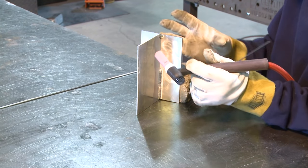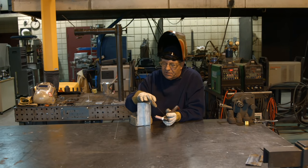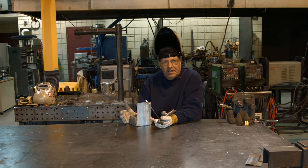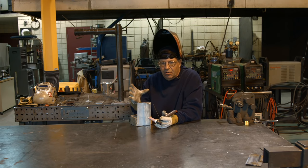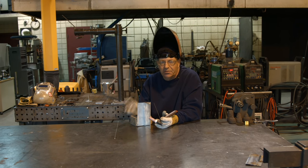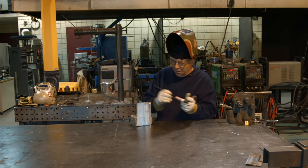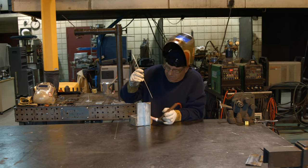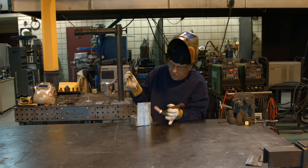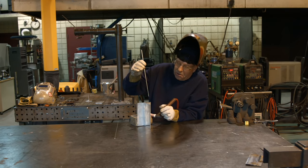There are a couple of things about doing this on aluminum. This thing is going to transfer heat quickly and just heat soak up at the top. I've seen a lot of people start out making a really beautiful weld and they never get off their heat — they get up to the top and their weld is real wide, real blown out, real flat. I'm trying to get a good angle for the camera. This is kind of freehand because I'm really not holding on to anything — I'm just touching back here on my forearm. Let's see how good or bad I can do this one.